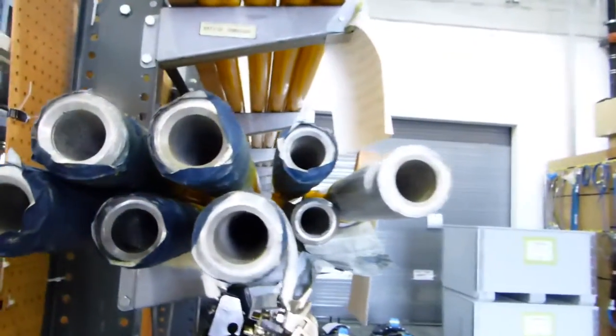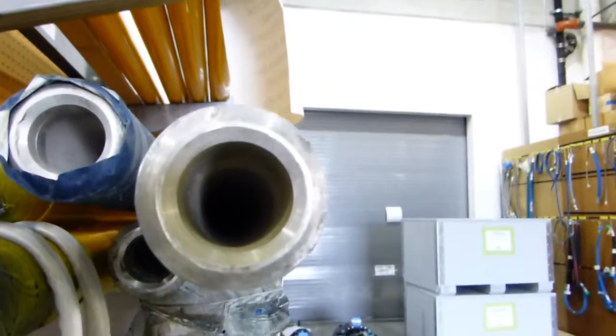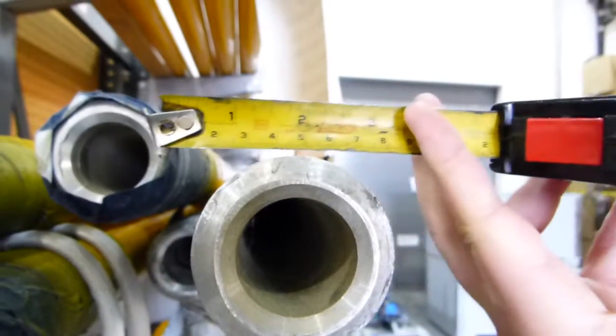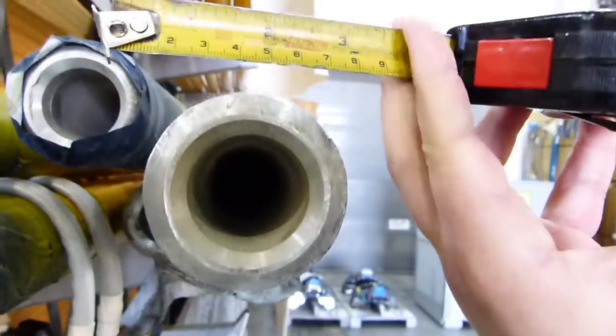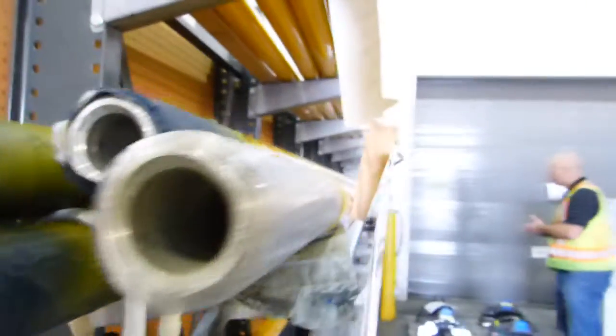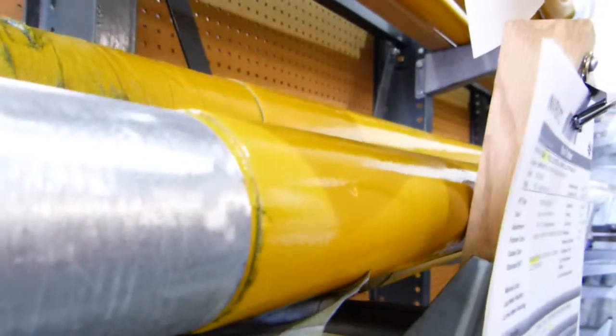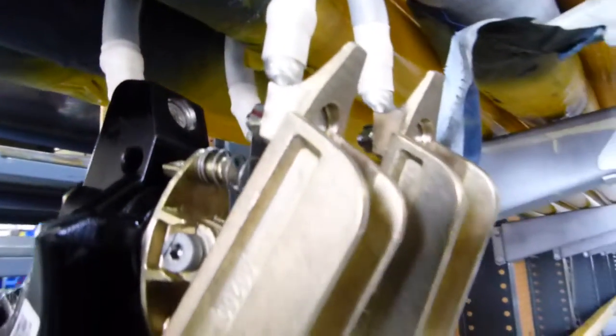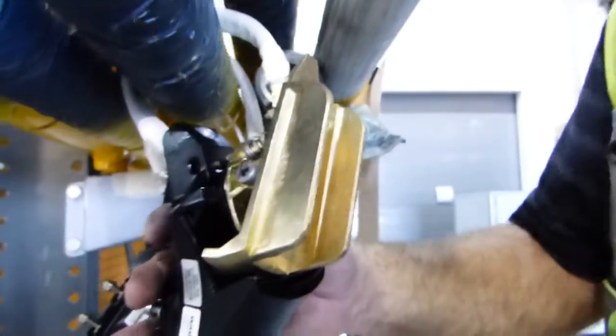Spare parts. These are serious conductors. The fiberglass wrapping is rather thin — just about a millimeter — just enough to insulate and keep it safe from the weather. And look, these are the contacts — those are brand-new ones. The shoes and the insert would just sit in here. The travel direction goes this way so that the carbon is pushed in. What are they made of? Brass.